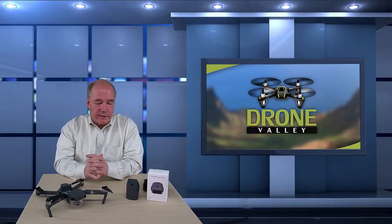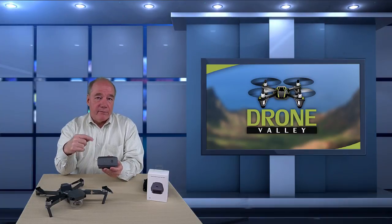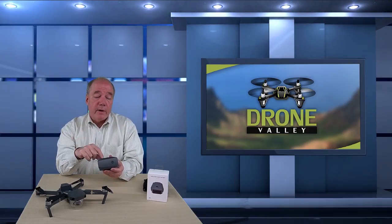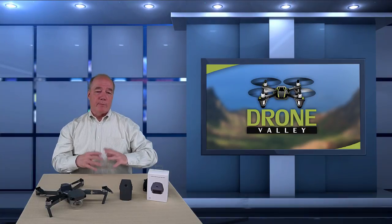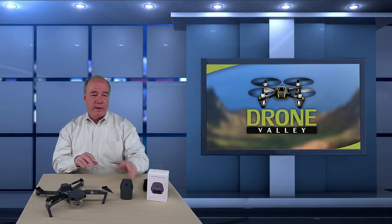Before I get into the discussion about this technology, let me talk about lithium polymer batteries. LiPo batteries have been around a while — they're an incredibly powerful battery providing the largest amount of energy per unit of any commercially available cell, certainly in the consumer space. It's the same technology powering the Tesla. But that comes with blessings and curses. The curse is that the chemicals inside are volatile. As long as they're inside the battery you're fine, but if exposed or mixed with water, air, or conductive materials, there's potential for fire.